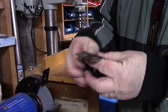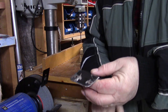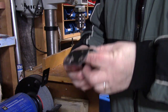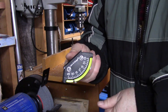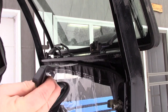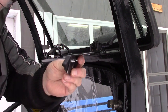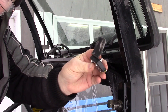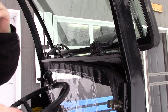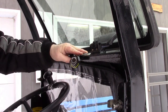Now it's just a matter of going out and putting this on the cross member on the cab. There are already a couple of holes there. I'm going to use self-tapping sheet metal screws and just pop that on there. Then I can adjust this bracket to be perpendicular. Before I come out to the tractor, in the shop I put this in the vise and I just put a little offset in it, because this cross member that I'm mounting on is not level. So if I set it like that, my gauge becomes level.